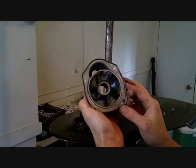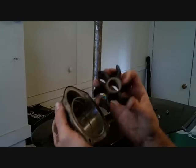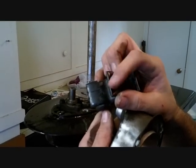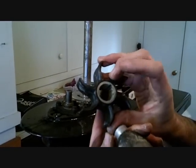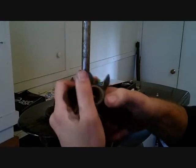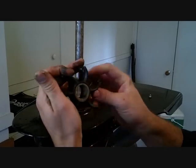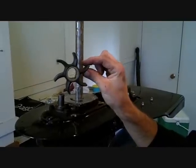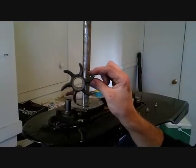Don't lose the keyway. In here, this is your impeller. This engine hasn't been run for a while so the impeller is quite stuck in there. To inspect it, have a look at the tips of the blades for any signs of wearing or burning, and the top and the bottom of the impeller. You can also pull on the blades to see if it's coming away from the bush. Because this impeller has got curved blades, it means it's been sitting for a while and it's got its memory, so it's not going to pump enough water at high speed. It's going to need a new impeller.